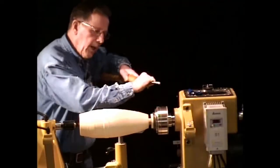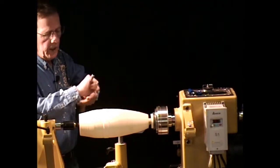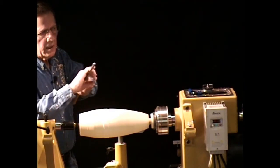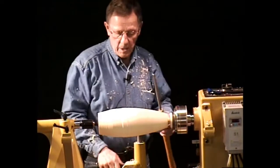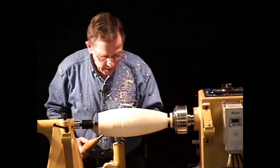And there's another cut here that you can use that's kind of tricky. If you do this cut here, be very, very careful that you hold on and turn. You're rubbing the bevel, turn until you just pick that cut up. Because if you turn just a few degrees more, you're going to get a really, really nasty catch. And we'll come over here and do this side.